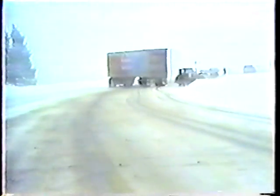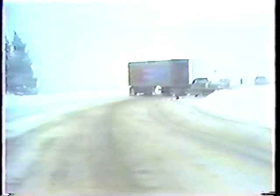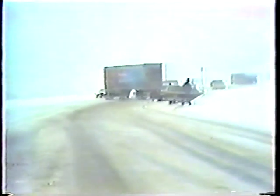Of course there are always exceptions. For instance, if there's heavy drifting across the road, the sand most likely won't do much good — sanding there would catch the snow, so instead of blowing across the road the snow would build up, making a worse situation. When there are two of you plowing, you should both sand unless the rear truck is directly behind the first truck — you don't want to plow off the sand that was just put down. A lot of it will be a judgment call, but if putting down sand will help give traction, by all means put it down.